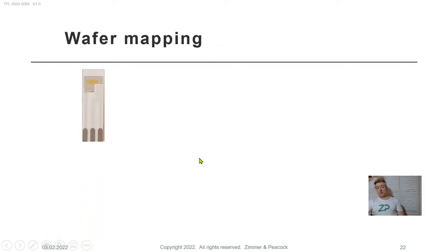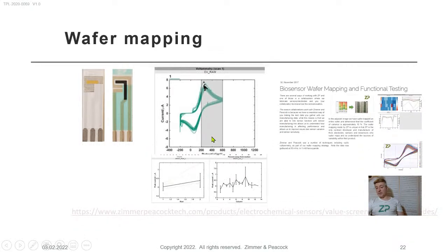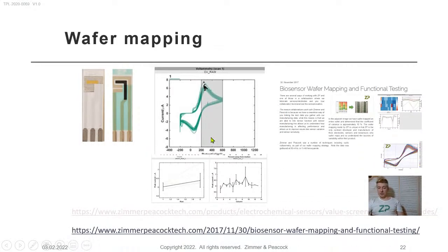Just be warned. We're very proud of our electrodes — we do something unusual: wafer mapping. For all gold electrodes we recommend, we go to the batch, test them by cyclic voltammetry, and make sure they're good. Same for carbon electrodes. We're generally the only company doing this — analyzing everything, uploading data to Julie, and making sure electrodes are actually good before they ship.